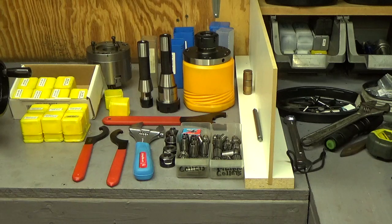Except for this particular chuck I just got on the lathe, I haven't been able to get really good results. It could be that the collets themselves aren't wonderful either - worst case on collets is about five tenths. I've fooled around with these collets and there is runout, possibly that much or more. In that respect this video is sort of incomplete, but okay - I'll call off now, talk to you later, thanks for watching.